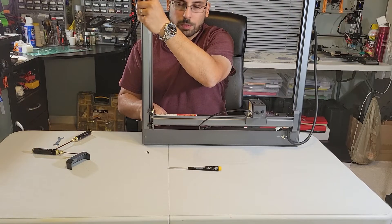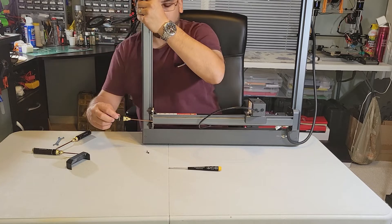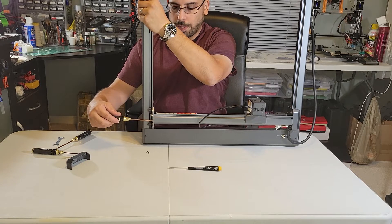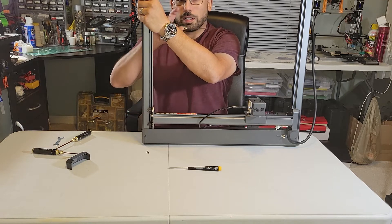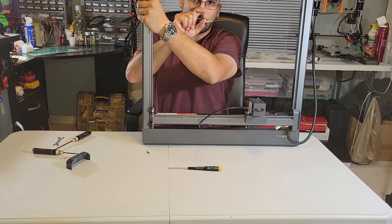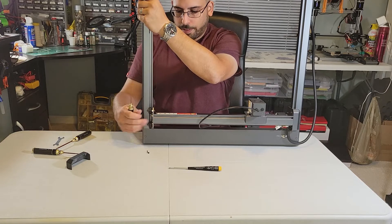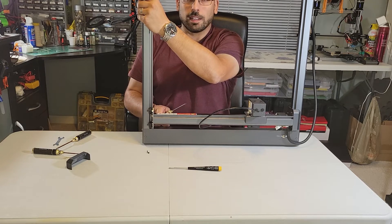Then you can turn the screw on the side and tighten up the belt. With the screw on the back loosened up, go ahead and turn clockwise to tighten the belt or counterclockwise to loosen the belt, depending on what the tension's like. You want to get it where, with a little pressure, you can squeeze the belts and make them touch each other — the top and bottom — without a lot of force. You don't want them super loose either.